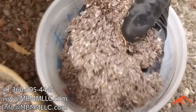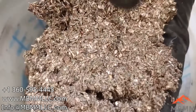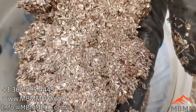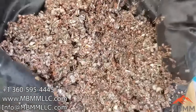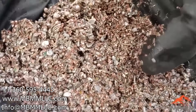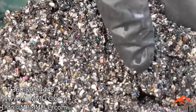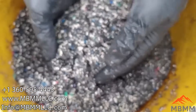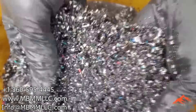Here are the results from our depopulated boards — just the components. The number one is full of pins and white metal with very little copper; there was hardly any copper on the table while we were running because we didn't have any of the boards. The number two has some copper but a lot of pins and a lot of the plated stuff. The number three has some metal but a lot of it is aluminum — from the aluminum heat sinks — a lot of plastic both black and white, and very little red or valuable metal. The number four is just plastic; there's hardly any metal in there at all.